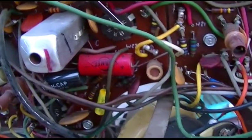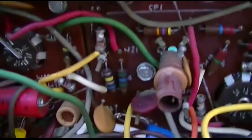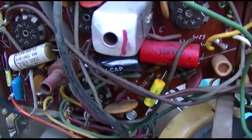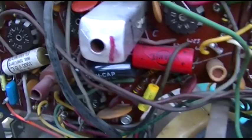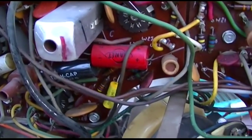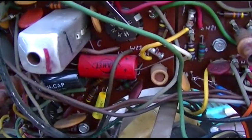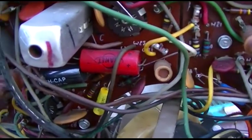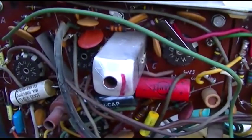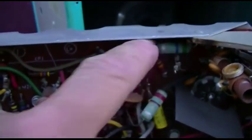I'm going to have to pull this board off to change them — you can't get to it from the back. So stay tuned for part three, where we'll start off with replacing this phase detector diode and continue on from there. This contrast control pot will have to be changed too.